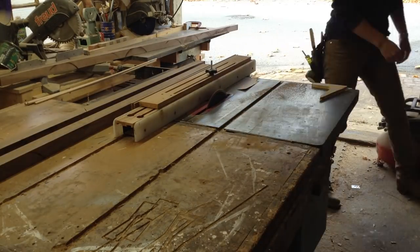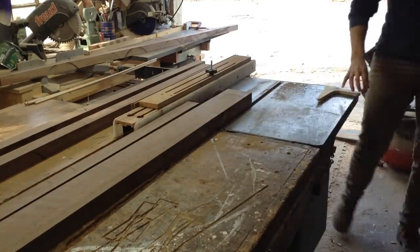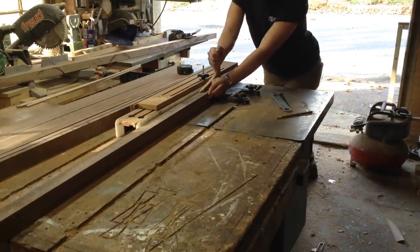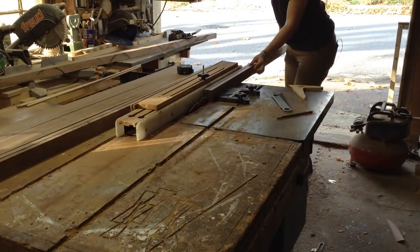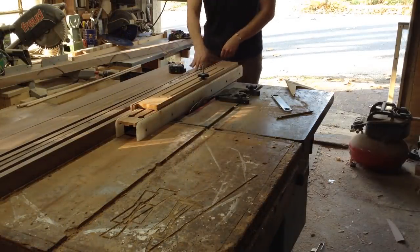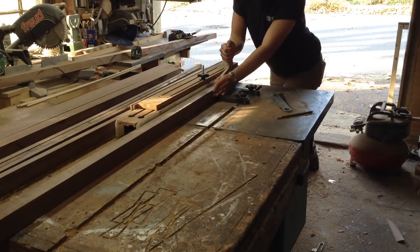I'm just ripping these into two-inch wide strips. The end frames for this piece have the strips turned on edge, all two inches wide. Once I had those I flipped them over and ripped them down the middle. This lumber was a little over an inch and a half thick, so I cut it in about half, and with the loss from the blade I was left with pieces a little over three-quarters of an inch — perfect. I cut just over 12 of these long pieces to make those edge panels.